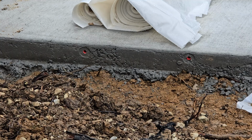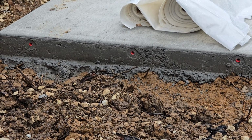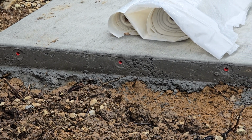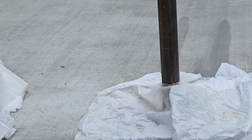that's good, because what it's doing is allowing a little room here for our rebar, for our concrete. When it shrinks as it dries, when the water comes out of it, then it'll get tight around this rebar and tighten it up. But it's not to the point that it's going to have any kind of cracking or major issues.